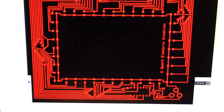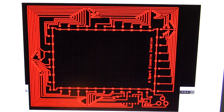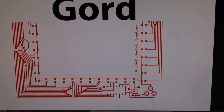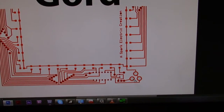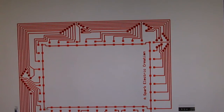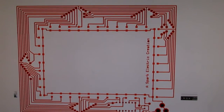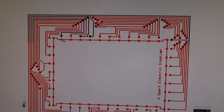If I print it out as-is, everything will be covered in toner and that's not what I want. So I get rid of the black background using the bucket tool — I'll go off to a light gray color since the little white dots are actually more of a gray. I leave all the little circles filled in because I'm just going to drill through the copper anyway. If you only have a black and white printer you can print it like this, but I highly recommend making all your lines solid black because otherwise your printer might only print a shade of gray.